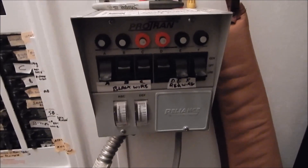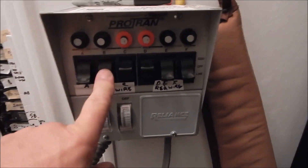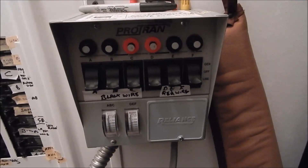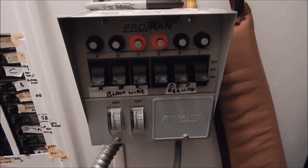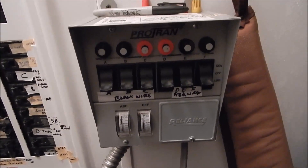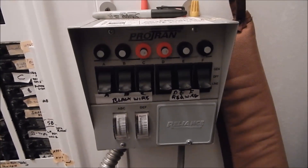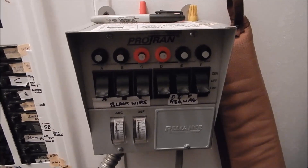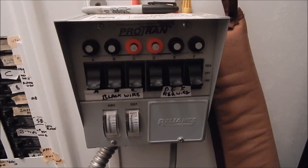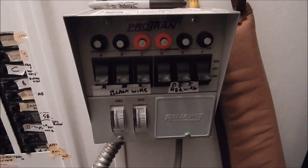Just to show what I do when I'm going to EQ my batteries: I shut the transfer switch and take everything offline so the batteries can rest and get a good charge. This is one of the best things I ever did — putting these six switches in. Normally it's powering the front half of my home, which in reality is pretty much just the refrigerator, freezer, the modem for the internet, and the TV if I ever turn it on.